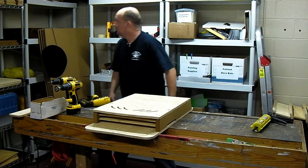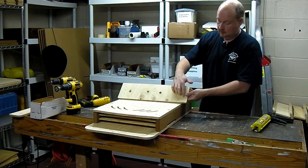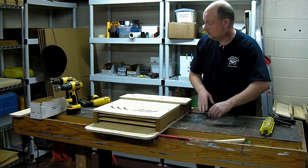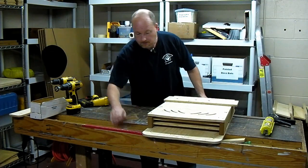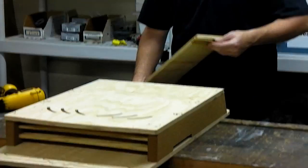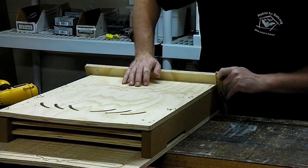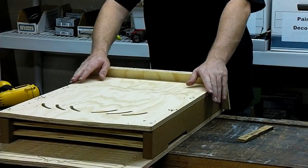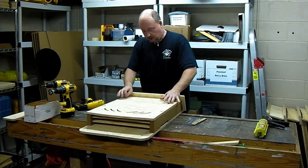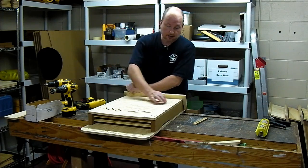Now we're ready to put the roof on. We'll get the three-chamber roof — it's all pre-cut and pre-marked so I'll know where the drill hole is. We'll get our roof spacer and drop it into the dado. I tried several different ideas to line the roof up and the dado just worked out best — it holds the roof in place and ensures a good weatherproof seal, and it actually adds a little strength to the house. For those who don't know, a dado is just a fancy word for a slot cut into the wood.